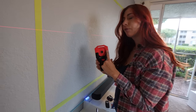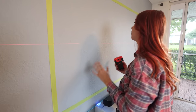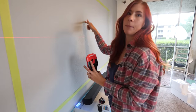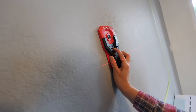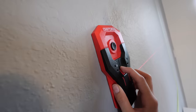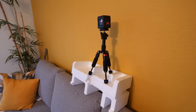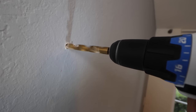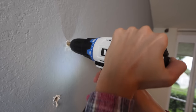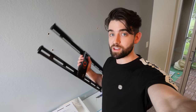For hanging the TV, we had to get a stud finder because the TV weighs 98 pounds. You don't want to just put it in drywall or it's going to fall out — and it's an expensive TV. In this apartment, we have metal studs. With the stud finder, you just put it on the wall, press the button, and it beeps when it finds the stud. We've already marked it. We also have a laser level, again linked in the description. We just finished drilling the holes into the metal studs, so this thing is going to be super secure.